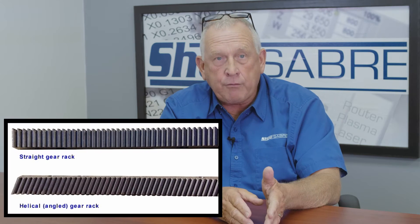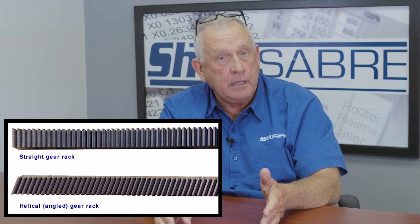We have a real problem getting rid of that backlash. When you get to the under $60,000 CNC machines, the technology choices are going to be straight racks and helical racks. The helical racks are a little bit quieter, and you can probably use a smaller one because you have a larger contact area, but there's a huge trade-off: it creates side forces that cause wear and tear on associated components. So long term, you're going to have a lot more maintenance on things like planetary drives because there's no way around it.